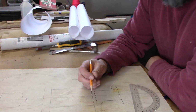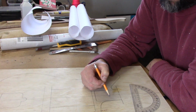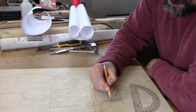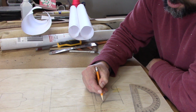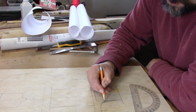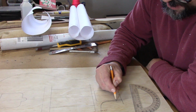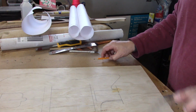And a pet peeve of mine is when the neck pocket is undersized of the neck. So I want to stay like a good 1/8 of an inch on this template, and then actually fit the body to the neck. You know what I'm talking about? All right, let's go to the bandsaw and make this thing happen.